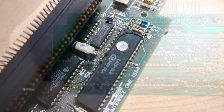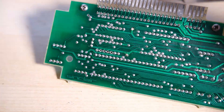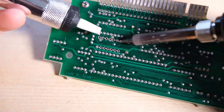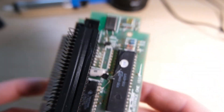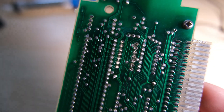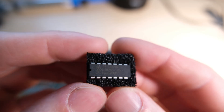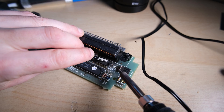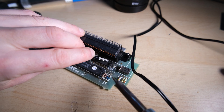Now we can get to work removing the chip. It's always an option just to cut all the legs, although it's a bit brutish, and I can always do with the practice to remove something carefully. Plus with the edge connector hanging above it, it's really tricky to get at with the snips. I think that's looking pretty neat — I was careful to clean up the solder splashes. I popped the replacement chip in without a socket because it wouldn't fit with one, and also remembered to put that patch wire back on.